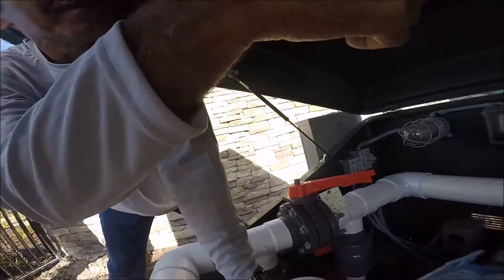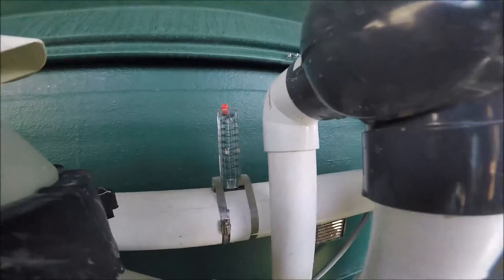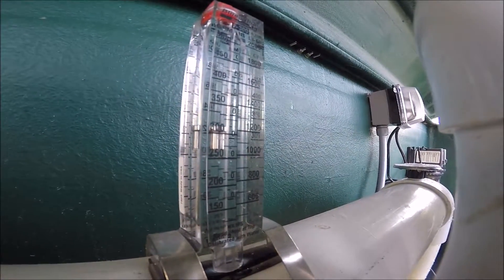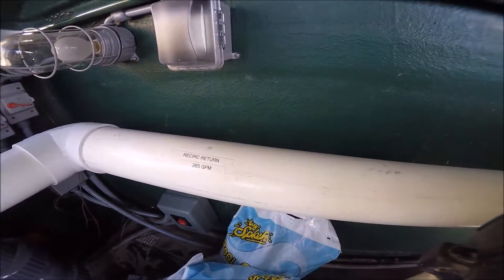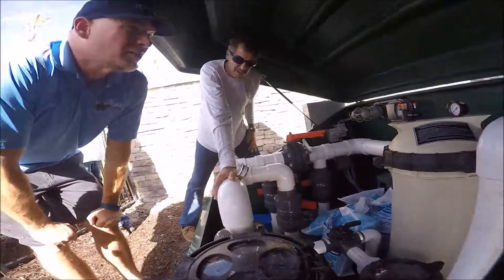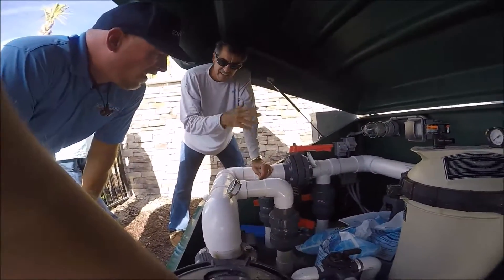Let's look at our flow meter over there. What are we flowing? A little bit about 300 gallons a minute — we're running much higher than what it needs to be, so cut it down a little bit. It's right there. Leave it at that notch — it works pretty good. Leave it right like that.